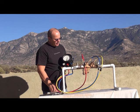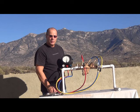We're going to open our bypass one turn and leave that open, then take a reading. As long as it doesn't drop to the relief valve opening point, it means the second check is holding tight. It's not dropping — we've got a good second check.